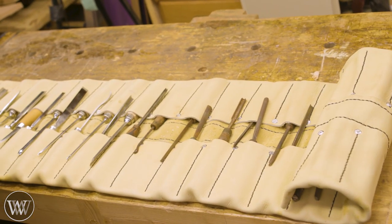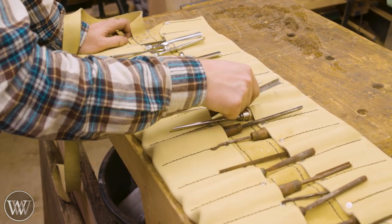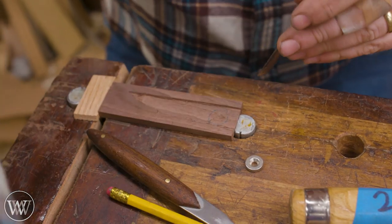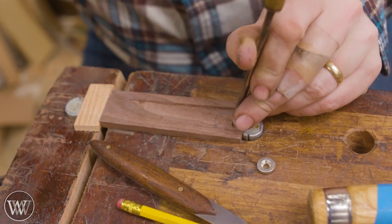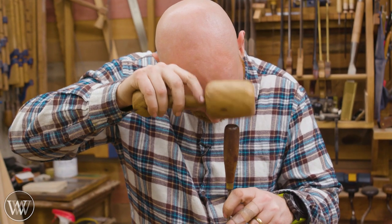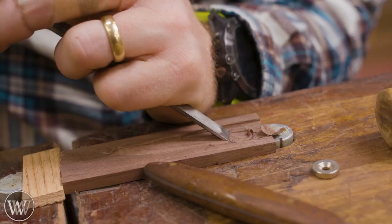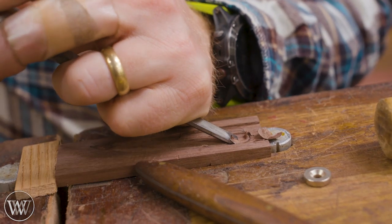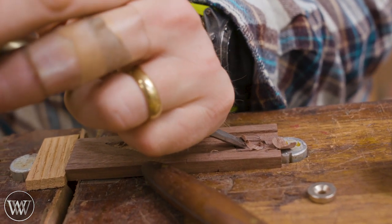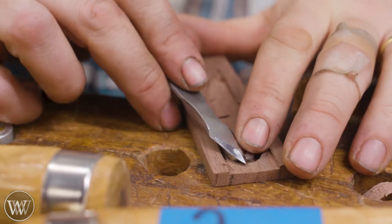Now let's do a little bit of work in this — we need to attach a magnet. For that, I need a gouge about the same roundness as the magnet, a bit larger. You can see the round magnet I have right there. I'll leave a link to the magnet and other things I'm using in the description down below. So we can take this gouge and mark out a little space near the entrance, then chop down a little bit and pare out, chop down a little bit and pare out.